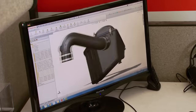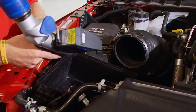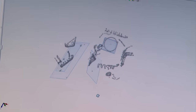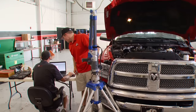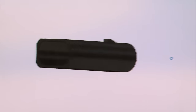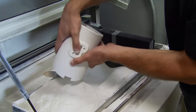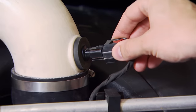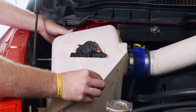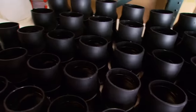They also design high-flow cold air systems. Down in the R&D shop, the guys are developing one for a new Dodge Ram. A faro arm provides a virtual simulation — in the design phase, data clouds and vector lines are collected and imported into CAD-CAM software. Once flow testing and stress analysis is done, Bully Dog uses 3D printers — one for small parts and one for larger pieces — and what would normally take weeks to prototype now takes hours. They have instant measurements and instant prototypes to test for fit, form, and function. Things can get designed in a week and go off for production quoting. These prototyping machines are becoming very important for them to be first to market.